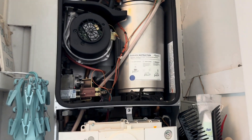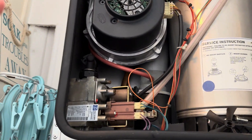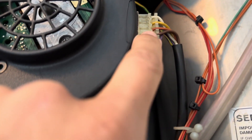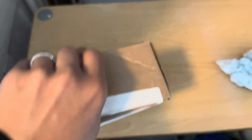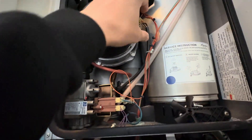So I'm back here again at this job. The last video cut off basically when I went to turn it back on and it sparked a little bit. We've got 240 volts to the fan — testing the purple and the brown we got 240 between them, which generally means the fan is at fault. Because the job's already quite pricey I got a fan circuit board — first time I've fitted one of these, but let's give it a try.